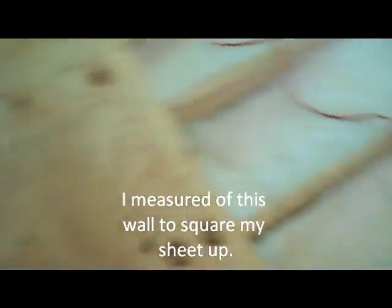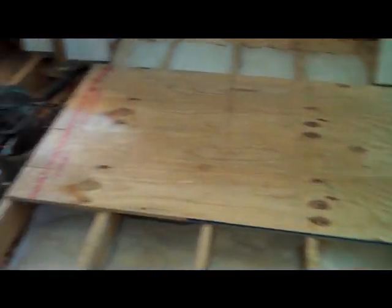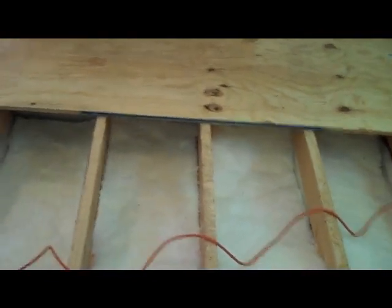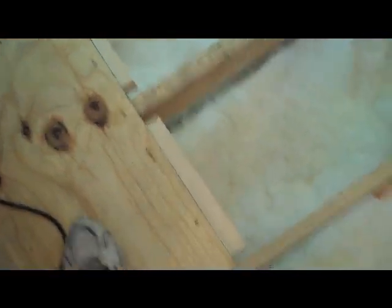Alright, we've got the insulation down. Now we're taking our first sheet of 23/32 plywood and we're just going to find the best place for it to break on that floor. It breaks right there — eight foot long, no cutting. The next one will go from there that way to fill in the end. Once you've got your first sheet down, I also added another piece in between every floor joist. Take some short pieces — they don't have to be the full width — and put a couple screws in each side so that when you put your next sheet down beside it, put a couple more screws in it, and it will be solid right there in between every bay. No push, no up and down.